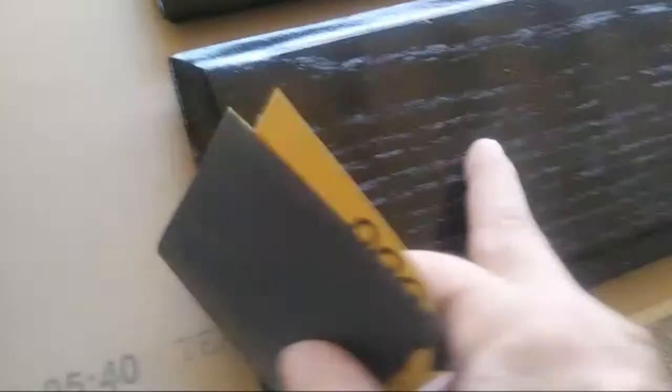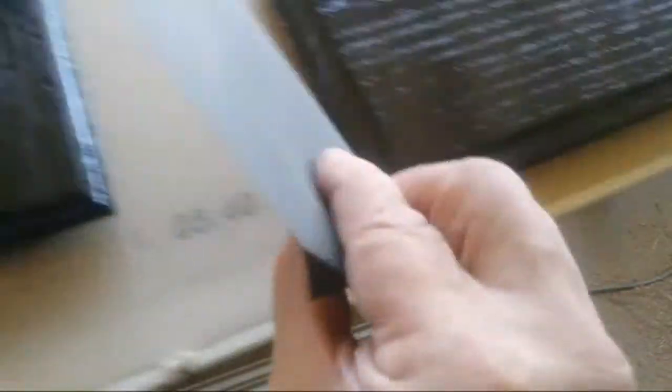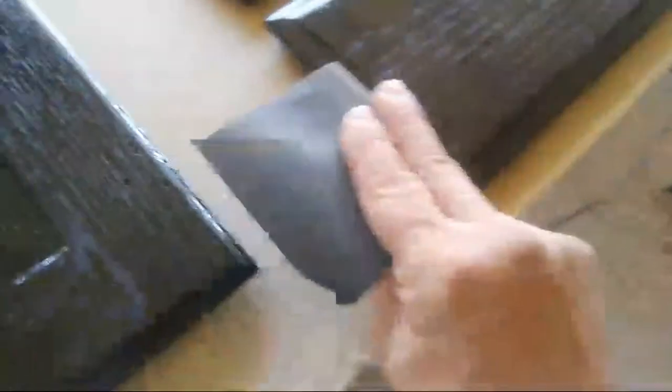All right. Okay, so you can use that. This is completely dry. You do not want to do it when it's wet, because you'll remove the stain. No, you do not do it when it's wet. Okay. Now I'm going to come with the grain. All right. So you just kind of catch this detail here at the top of that door face and then come forward. All right.